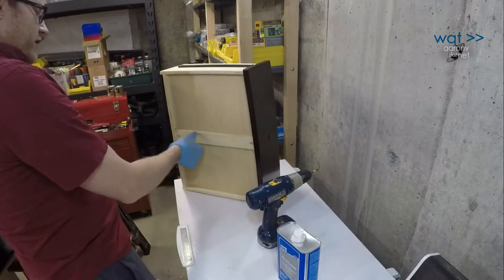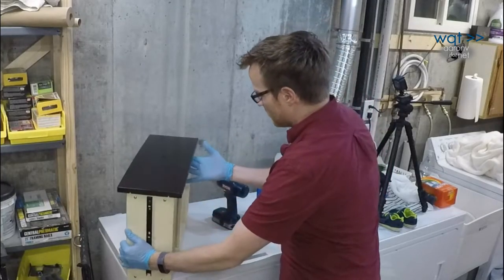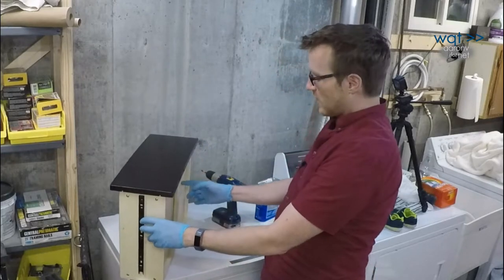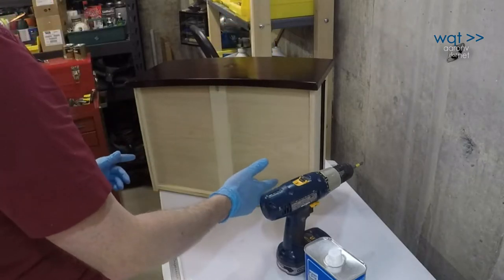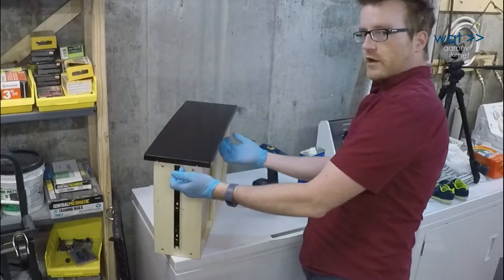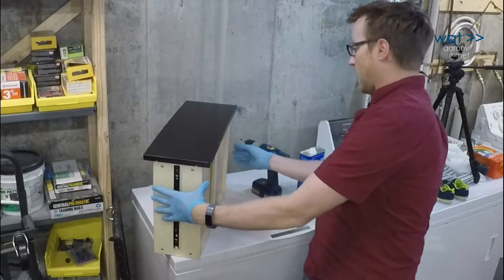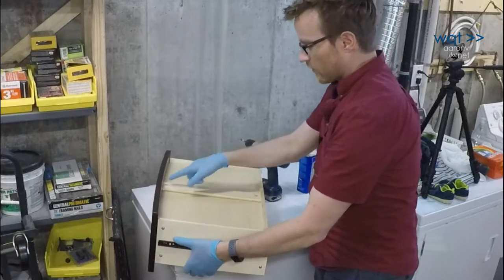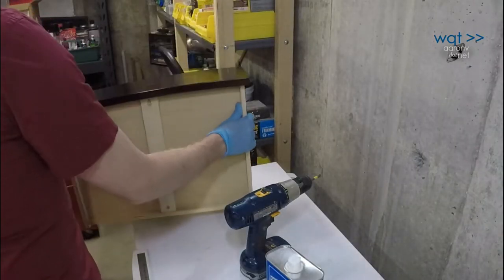put glue in the slot here, and then reassembled this piece onto the back, and then tipped it upright, dropped this base piece, which is thin, but it has reasonable support from this section right here, dropped that back in, and then put glue on the two assembly pieces here and the hole here, dropped this on, put two more screws back in, and one more screw back in right there. And already, these things feel like real solid drawers.